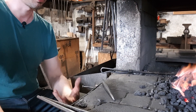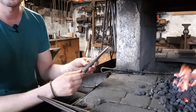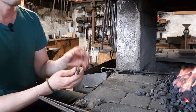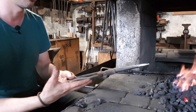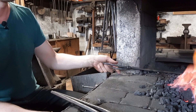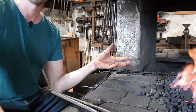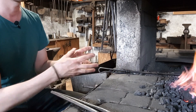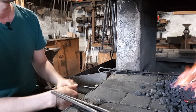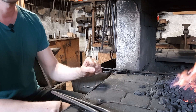Welcome back to Nordbana. My name is Hans and you just saw me forge this round punch. By forging it, I applied a lot of stress — potential stress — to the material. Having that stress in the material is very bad, as it can cause what we call catastrophic failure, meaning the tool or material cracks or explodes. To remove that potential stress, you also saw me normalizing the tool: heating it up to an orange color, about 900 degrees Celsius, then letting it cool down slowly until I could hold it without burning myself.